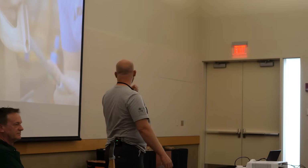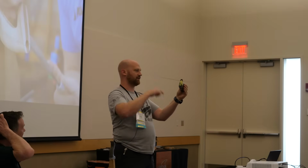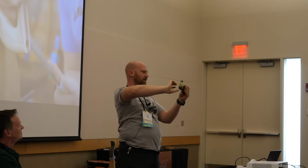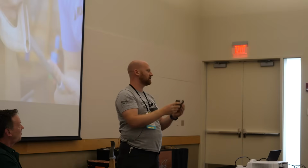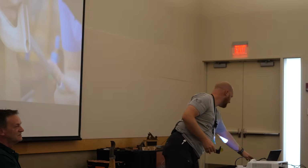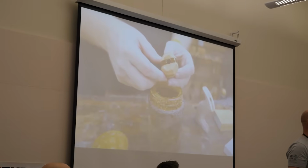Yeah, so if you don't have that hand screw clamp, put the hand screw clamp in your vise, and it allows you to work on it. I actually do it in quadrants. So I'll clamp the head here, and I'll do everything inside on the opposite side from my clamp. Then I'll rotate it, and I'll do everything on this side, opposite from the clamp, and then I'll rotate it again, and so I do it in 4 sections. Start with a really coarse rasp, go into a finer file, and a finer file until it's ready for finish. And I honestly go straight off the file with mine, unless I need a little more detail.